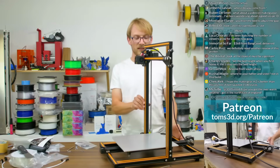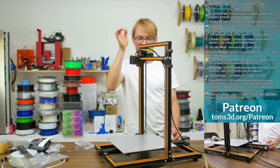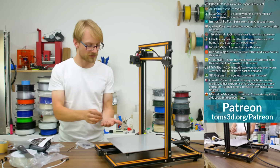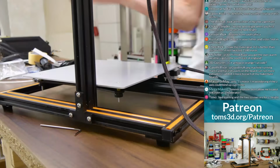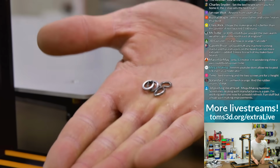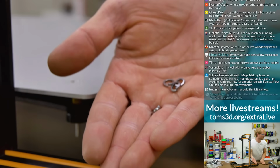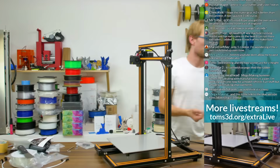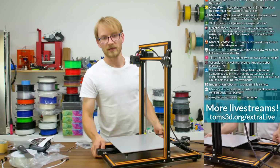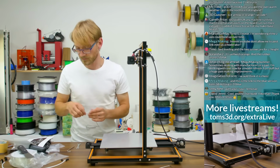Holy crap! It doesn't look like much, but there is a bit of vibration. It does rock back and forth a bit, but really no issue. By the way, I left out these supposedly locking washers. They do more harm than good. They have been proven ineffective time and time again, and they don't really do anything. If anything, they add springiness to the connection, which you don't want. So I'd rather have it tightened up hard.